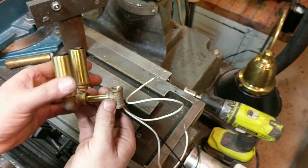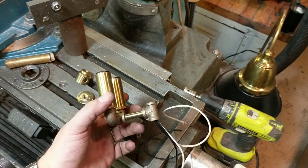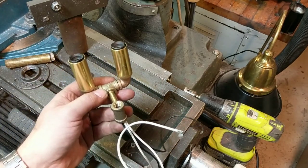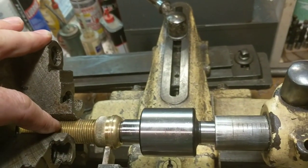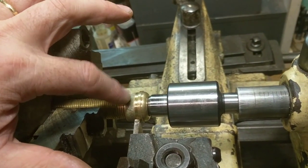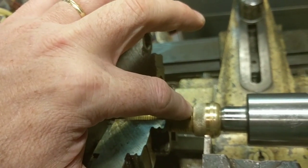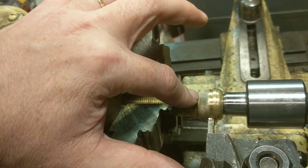After a whole lot of messing and finickiness, I have that going - though I need to spin it around since this has to be facing up because I want the bulbs in an upward orientation. I have this brass threaded shaft lined up in the three-jaw chuck - this is a miscellaneous plumbing piece for connecting a sink to the supply. I just finished knurling this edge and I'm going to take a little cut here and there to cut it off. What I'm making is a little threaded ring to hold the glass globe up into place.